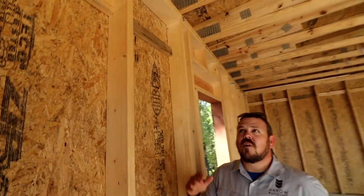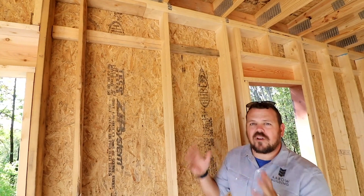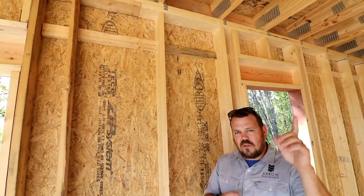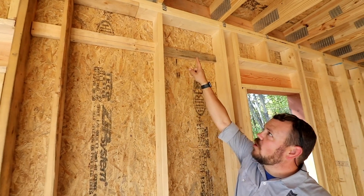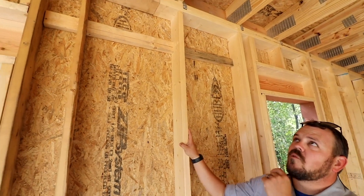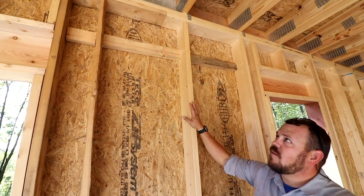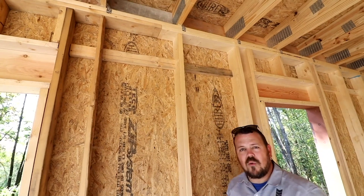Right now we're in the garage part of this build, and this garage is not worried about air sealing. So technically I lied to you — the backside of the zip sheathing here is just a water barrier in this case, but you'll see in a minute where we're headed. The reason we're starting here is I wanted to show you the detail up at the top plate. That is a standard detail where we have a raised heel truss to get a bit more insulation, and then we have that hurricane tie tied to the top plates. Everything stacks, everything's secured all the way down.